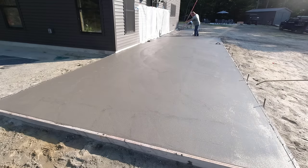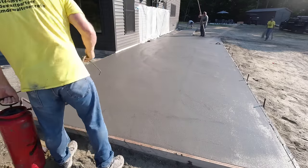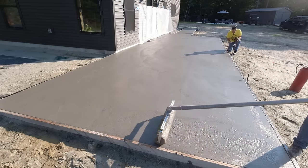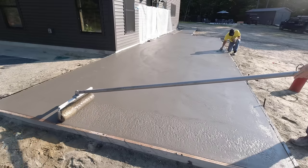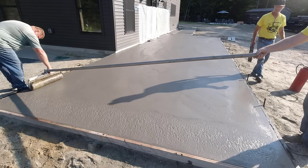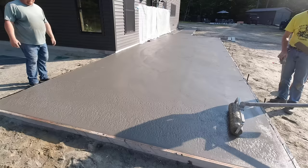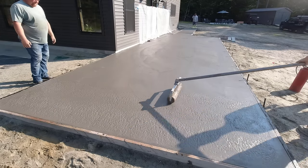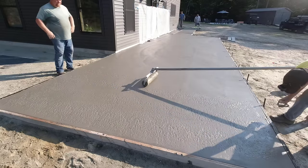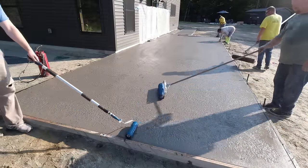Darren's got a clear liquid release going. We'll come back the next day and do what's called a texture enhancer — almost like a colored liquid water that we spray on, which adds a secondary color and an antiquing effect. The concrete already has color in it — it's gray — and the texture enhancer color we'll use will be charcoal. You won't see that in this video but you'll see it in the next one. Make sure you like and subscribe so you can catch all parts — I think there'll be four parts to see everything, including another whole section on the other side of the house.